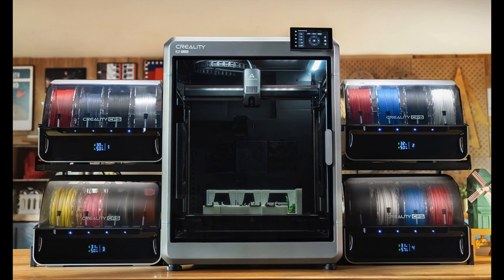Except the Creality K2 might have something to say here as well. Unlike something with lockdown firmware, with Klipper you can get in and add arc moves, write custom macros, change the motor drivers — you can do anything. That's the point. I love having that functionality and I really recommend having printers with it, though I know not everybody needs or wants that. It's just something I value in a printer.